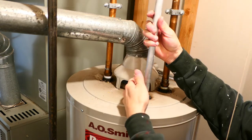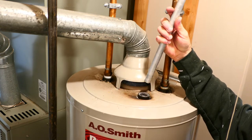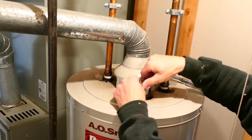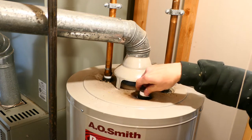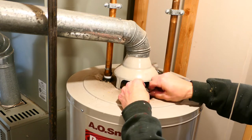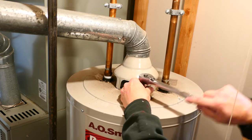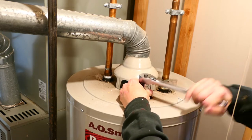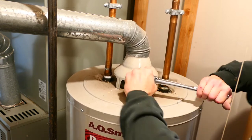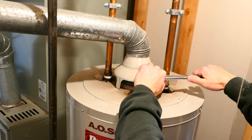You may also want to clean out the threads here if needed. This is pipe thread, so it will seal as it gets tighter. Now if this were long, you might hit the ceiling before getting it in — that's why you'd want to look at that other folded type. But this shorter one is easy to get in. Get the threads started. It needs to be tight, but not as tight as it was to get off — honestly, that was just from being old. I'll get this good and tight; when I'm starting to move the water heater, that's plenty.